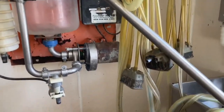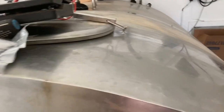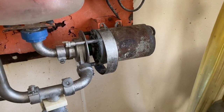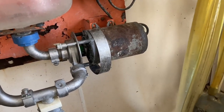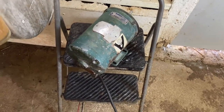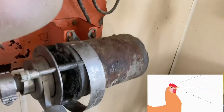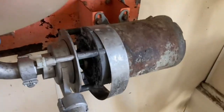We're in our milk house here and this transfer pump that pumps the milk from the jar over to the bulk tank is running really hot a couple times. So we've got another used one that we found that went through the electric shop and made sure it was good. We're gonna replace it — you can hear there's a bearing going out of this one.